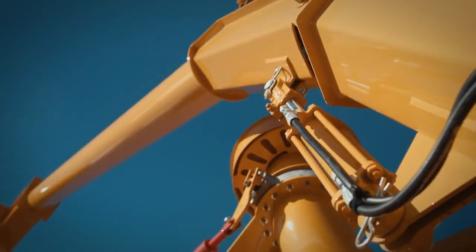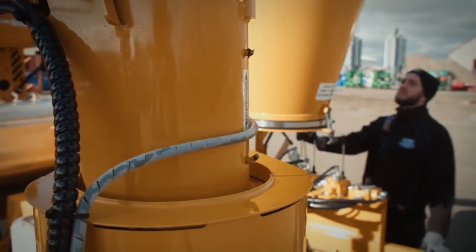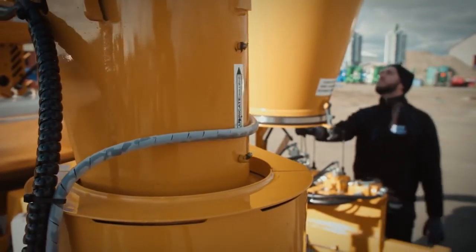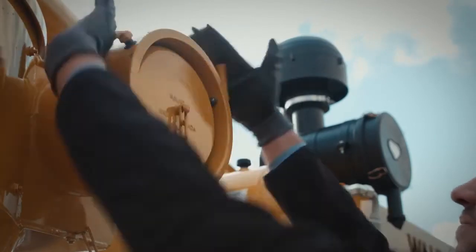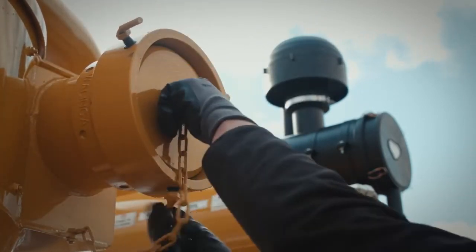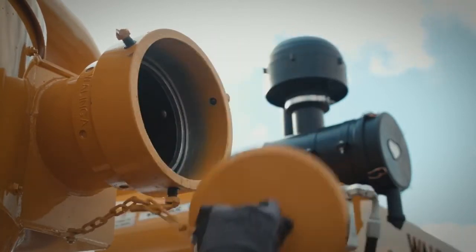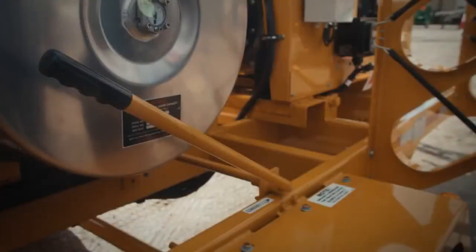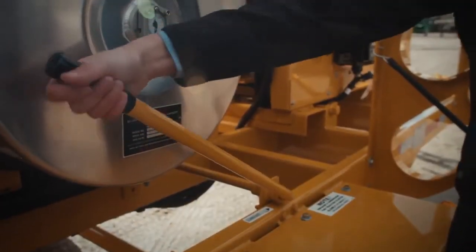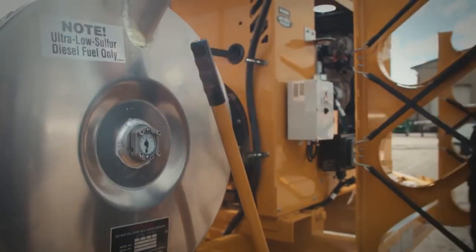The hydraulically operated truck loading boom with the Rhino line cyclone can be lowered or raised and rotated as far as 360 degrees if necessary. The operator demonstrates how the cover to the intake of the receiver tank is opened and closed — securely fastened with Walinga tail bolts on each side and bottom, and secured safely to the machine with a chain. The power to the blower from the diesel engine is hand engaged or disengaged by a large clutch lever on the side in front of the fuel tank.